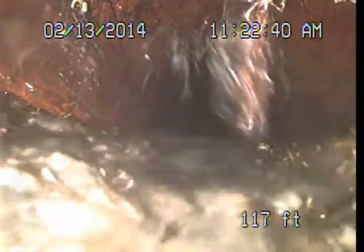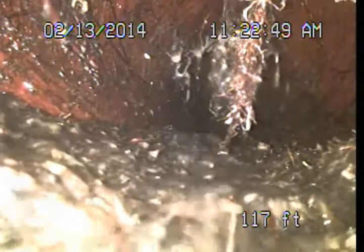What we are looking at is some pretty significant root intrusion on this lower end. We are in a vitrified clay piping and root intrusion in these clay pipes is fairly common. But it is a situation where we are suggesting it would need to be maintained on a regular basis to help minimize the potential for blockages and damage to the pipe.